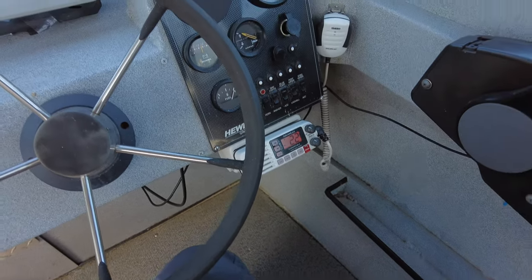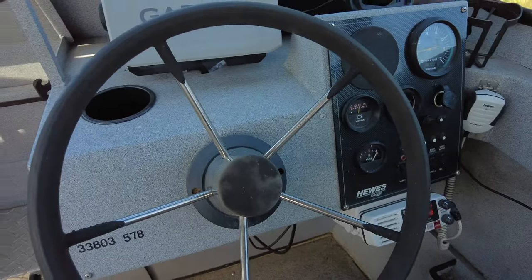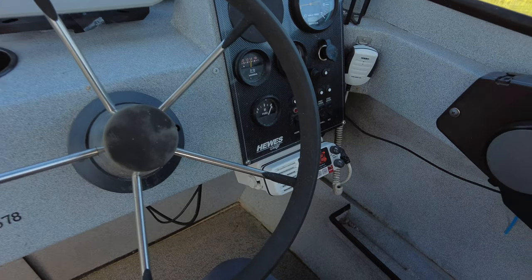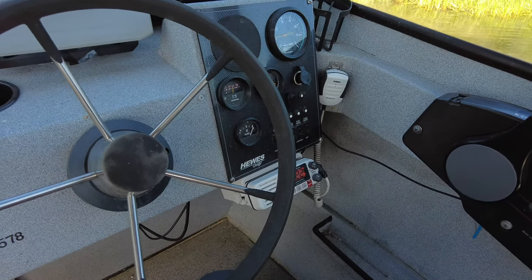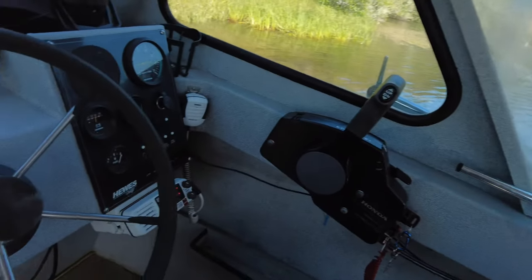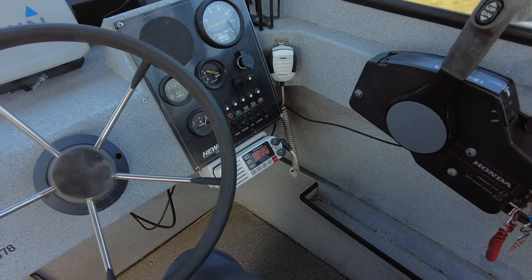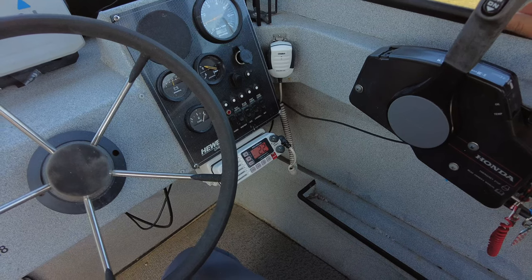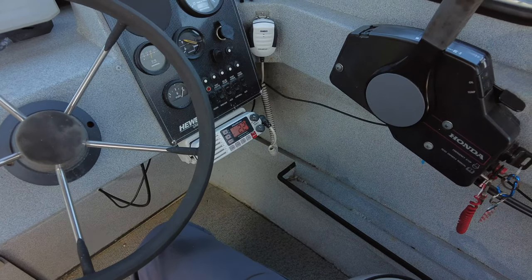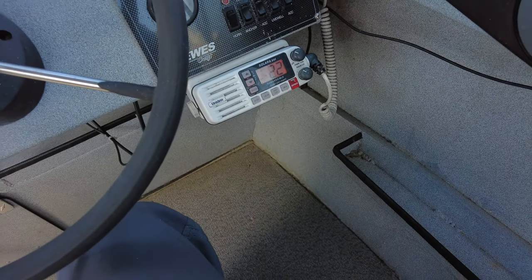668.1 hours on the engine. The Garmin, I couldn't get it to turn on — we need to check the fuses or whatnot, but it's not turning on. Motor's running as you saw on start-up. It is carbureted, so you push this fast idle all the way up, hold it while you're cranking it, hold it all the way up, and it'll sputter and jump around a little bit, then you just drop it down real fast so it doesn't rev up real high. Oil and temp — no lights there.